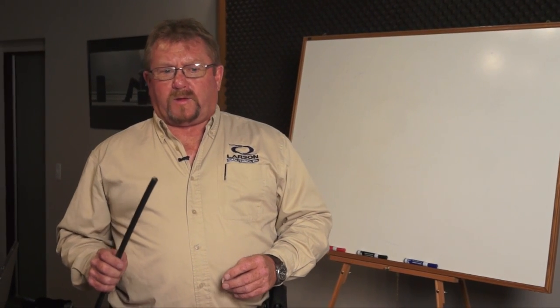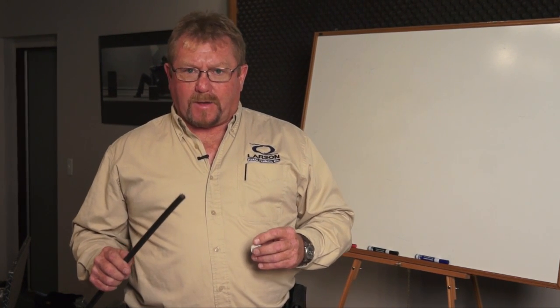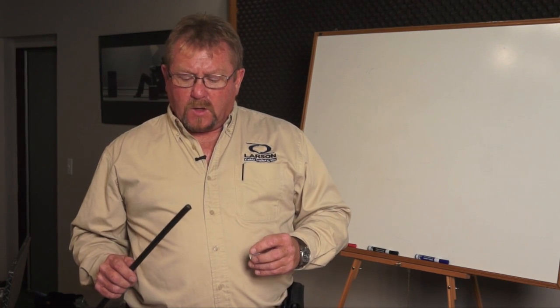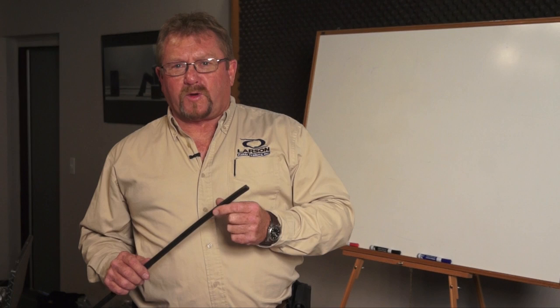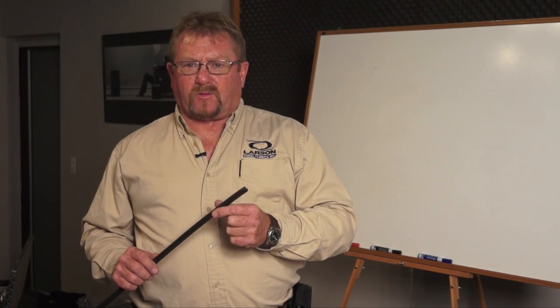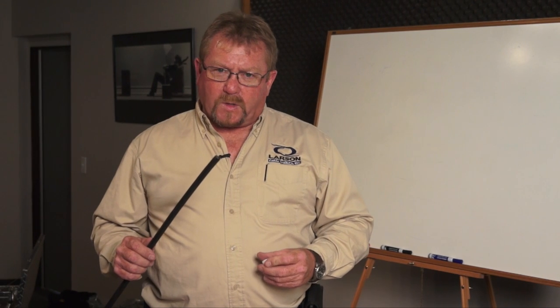When we get ready to blow fiber optic cable, the questions we need to ask before we show up on the job site with the right equipment, tools, and cable pack: we need to know the cable size. Most commonly people refer to cable size as the count of fiber in it, but the information we actually need is the outside diameter of the cable so that we can choose the proper seal to go over the outside of the cable.